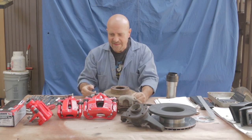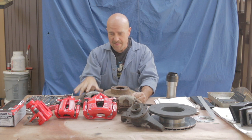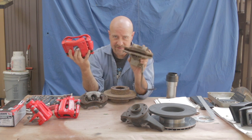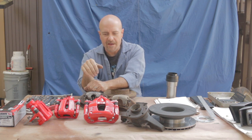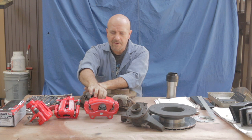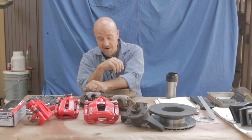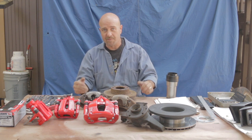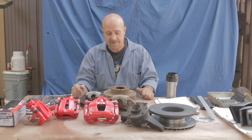Weight-wise, the rear is actually very comparable to the original, but this front brake caliper is a hell of a lot heavier. This original is aluminum and steel design, while the Abarth caliper is all steel. I thought I had read on the Fiat USA website that these Abarth calipers were aluminum-steel construction, but no — it's all steel. So I am going to be adding some unsprung weight mass to the front axles of the car. That said, all this should allow for much better, more reliable stopping and easier parts to replace if something goes wrong.